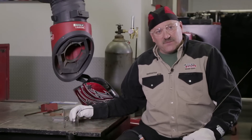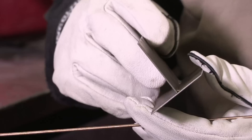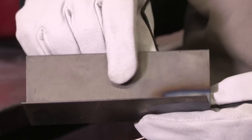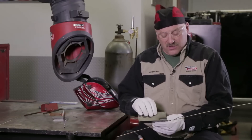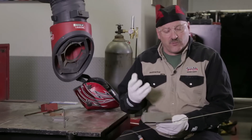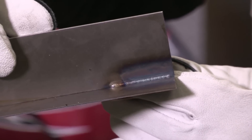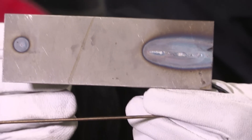The first project I'm going to work on is some thin steel. This is 18 gauge steel, and that's pretty easy to TIG weld. I've used a 0.045 wire and already made a little bit of a weld here. That's a weld with regular steel wire, not silicon bronze, but there's one little problem with that — I had to go pretty slow, I ran my current down around 48 amps, the material's right around 48-50 thousandths thick, and the weld looks pretty good, but if you look at the back side, you can see I have some burn through, and that's sometimes an issue with this.